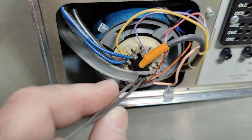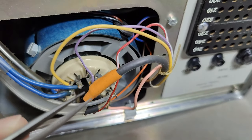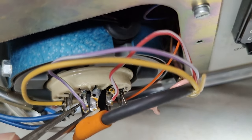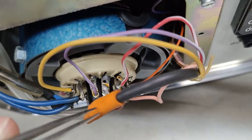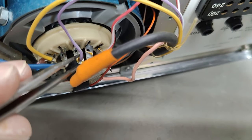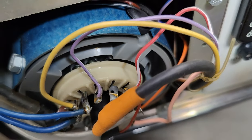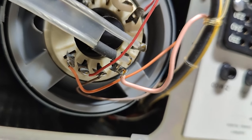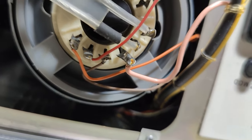There's another thing I wanted to show you while we are here. This is the vertical deflection, and that will be the brightness or the blanking signal. But look at that — this can't be good. They're not supposed to touch each other like that. This is why it is so important to do those inspections. Why aren't there any little plastic or rubber around these, or why aren't they bent away? It's all it takes to create a good, safe margin.